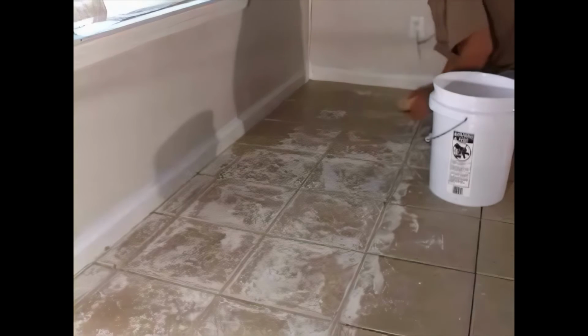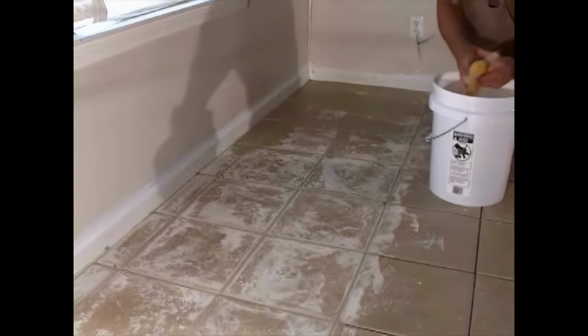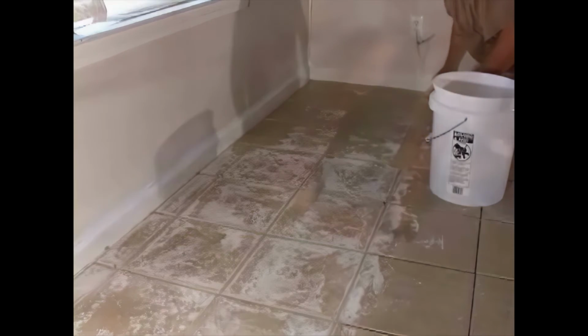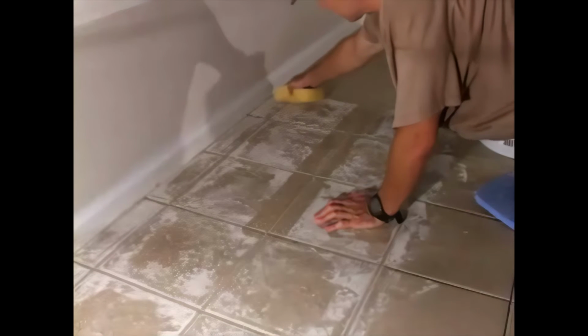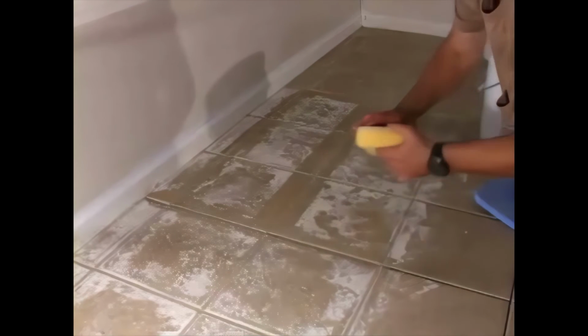After about 10 minutes, the grout on the surface of the tile will have to be removed. A grout sponge is great for this. It should be slightly wet but not dripping wet. Run over each of the lines to shape and smooth them, and then wipe off the excess grout.